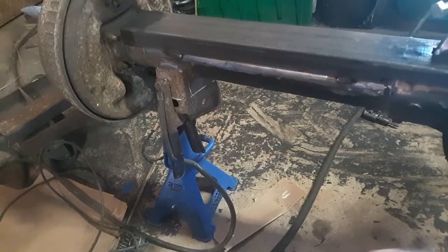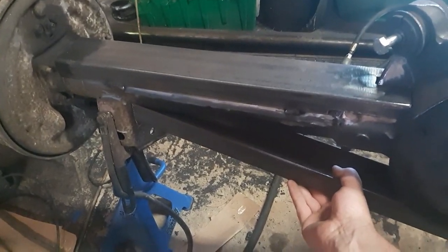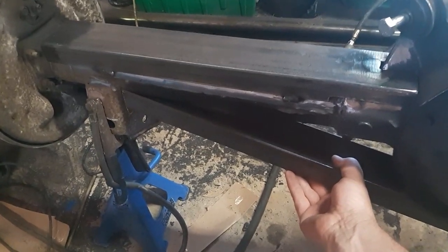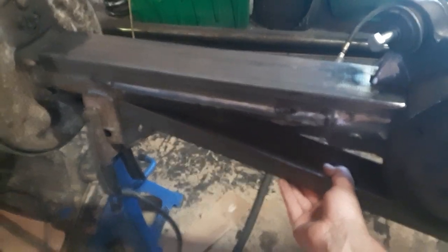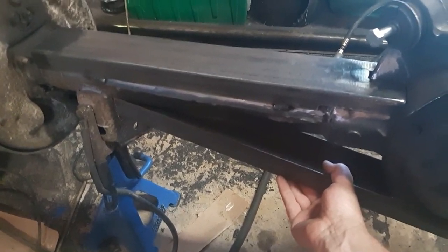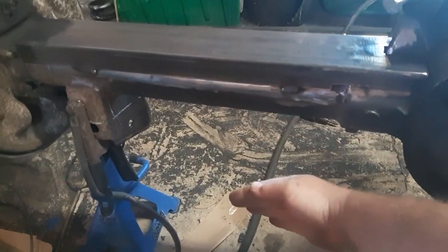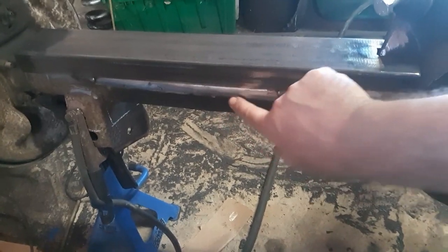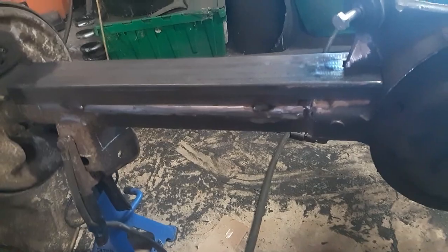I'm going to take my channel just like that, flip it upside down. Actually, I got a piece I'll show you right now. Run it something like that. It's kind of hard to hold it and film at the same time. But that way, I can run a straight piece of plate on the back side and the front side, and it'll keep everything really square. I've already clamped on a piece of angle, just run it straight down, and it touches the tubing just right on each side. Not too big of a gap, not too little of a gap. So I'm pretty happy with that.